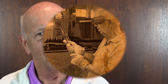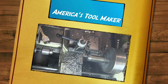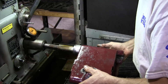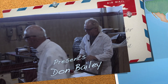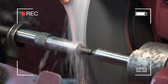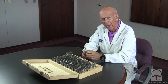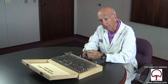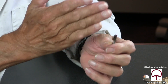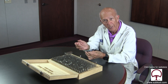Why do drills drill oversize sometimes? We think we know the answer for some of the reasons. If a drill has its point over to one side or off center, it'll push the drill to one side. We believe it's going to drill oversize — it just makes sense.